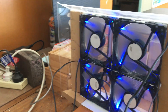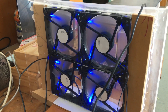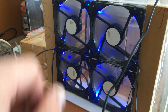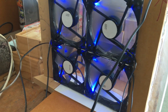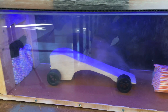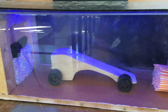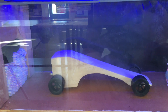To produce the suction power we've just got four DC computer fans all wired up to little adapters. You'll notice that this one isn't working at the moment — these three are using a 12-volt adapter, this one was a 9-volt and it just wasn't powerful enough. If you had a DC adapter box that would be pretty awesome, you could really crank up the power and suck that smoke through. It's quite a simple setup but it's allowed us to do simple aerodynamic testing of our carbon dioxide dragsters.